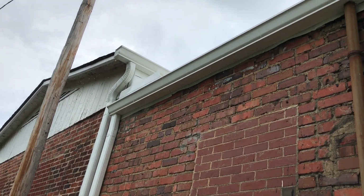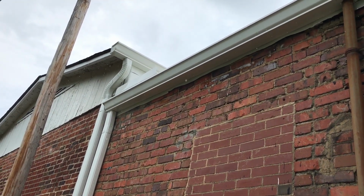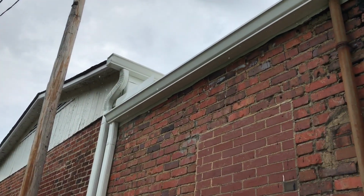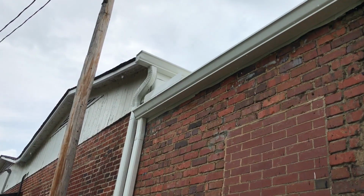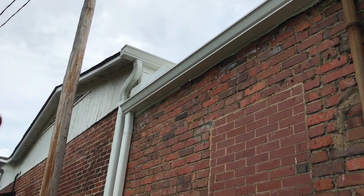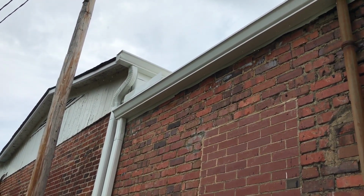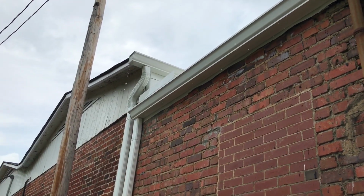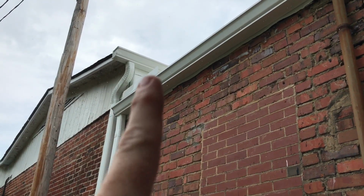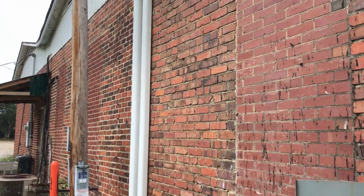All right, folks, we're out here working. Now, you may wonder, the water coming off the other building, that front gutter up at the top that we did, just deposits back on our roof, but we didn't really have a better way to do it. They had a pipe running all the way down, laying on the roof. We didn't really feel like doing that. So the water is openly running down the roof, just like the rain, and then going in the gutter. It's raining right now. But we have a little piece of stop basically up there for the water to hit if it's too much of it, so that it all gets routed into the gutter, and it's working well.